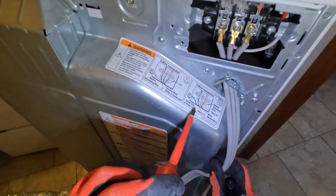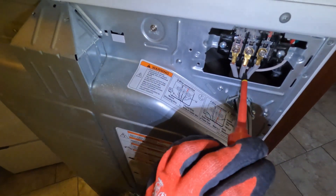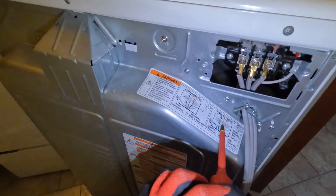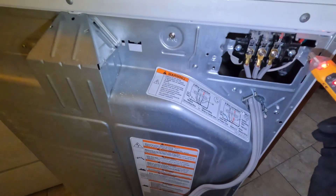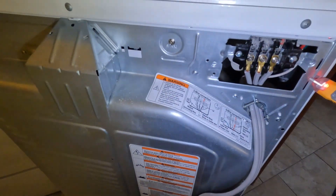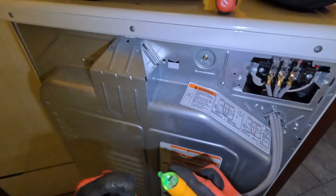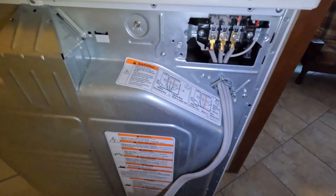But the four-wire connection is showing the neutral grounding wire is to be right there. So we're going to take that neutral grounding wire off and bond it to the frame and see if it stops buzzing. If they were to touch the frame, the frame gives them a shock. So let's change these wires around and see if we're going to fix it.